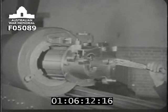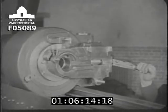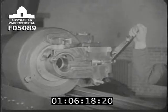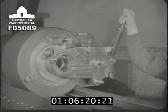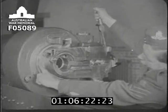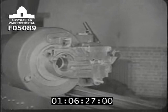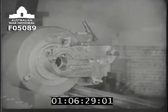Now, as the carrier is swung inwards, the breech screw enters the breech bush. When it's fully home, an upward and forward movement of the LBM causes the screw to rotate. Watch the red line on the screw, until, when the LBM is as far forward as it'll go, the screw is fully locked in the threads of the breech bush.